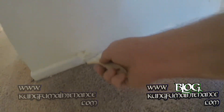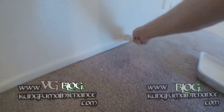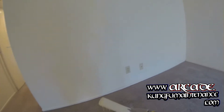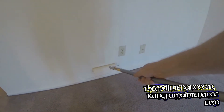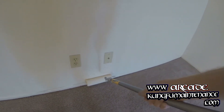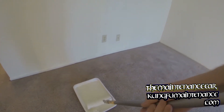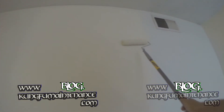Cutting lower, you just dip in your tray and cut it right in. I like to roll and paint kind of at the same time so that the whole thing will have one skin — it will all dry together and you get more uniform coverage. You also get to enjoy seeing the job get completed wall by wall or room by room, and you can see the progress pretty quickly. It's also very ergonomic for your body in that you're not doing only one thing — going around cutting in forever or just rolling forever. This way you're bending down, stooping down, reaching up, but spreading it all out over time, so it's more therapeutic for your body.